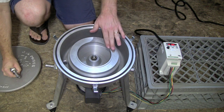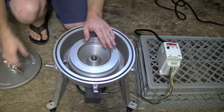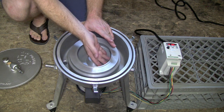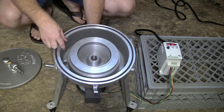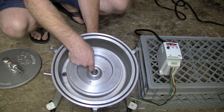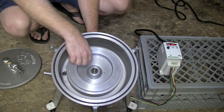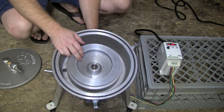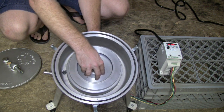Centrifuges work simply by having a big rotor inside that spins, and they use centrifugal force to force contaminants in an oil to the outside wall, which you can then take off and discard. There are two holes in this unit — one on the outside and one underneath the bowl. The good oil comes up and out these walls, and the nasty crap stays inside the bowl. Water also stays inside the bowl and falls through these three holes in the center here.